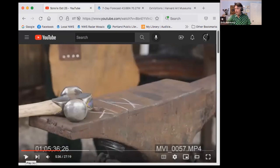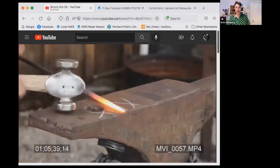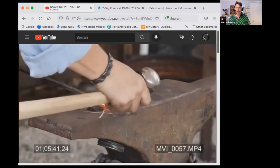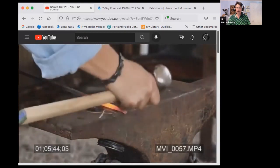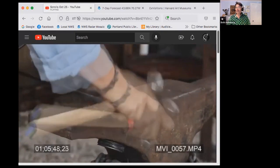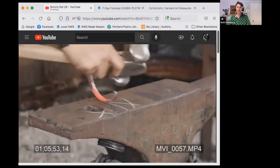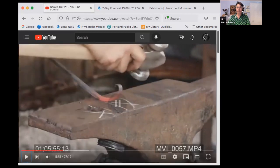So I'm going to be at a 45 degree angle, scrolling down over the air, feeding it slowly on my appointed spot, holding it by the hammerhead down, feeding it slow at first, and faster and faster. And it doesn't matter how much bend I've got, I can always tighten it. I just need to have some bend. So now, this is most of the rest of it: me looking and figuring out where I want to change it and then changing it. So I'm thinking the negative space in here is too big. I want to move this tip closer to here.